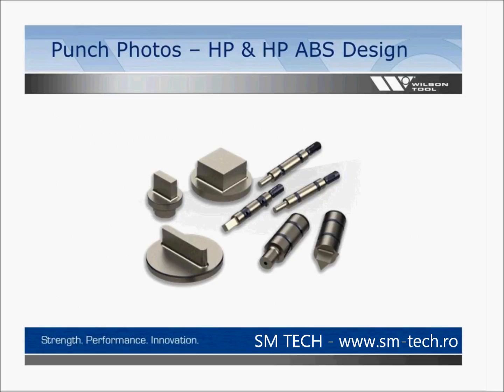These are our HP large station tools. They will work whether the machine is air blow or non-air blow. This tool here is an HP design that is non-air blow — no grooves, channels, or portholes. This other tool has a porthole here and a porthole here, which allows oil and air to enter through the top of the tool and lubricate it both internally and externally. These are our B station HP design tools.